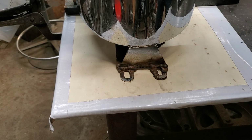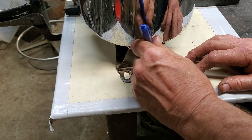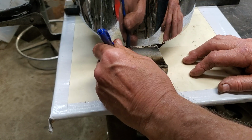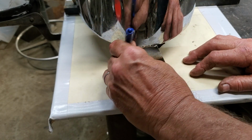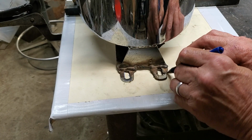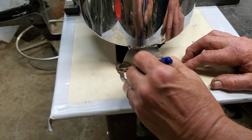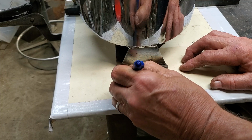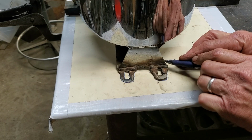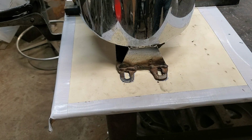And I'm not going to move this jig. So what I'll do is I will mark these. Now you can see those tabs are not the greatest. I'm going to do a 64th over a 3/8 hole, which is what it requires. I'm going to mill this out of 1 inch by 1/8 tab, and I'll cut these things off behind here and get rid of all that trash and let that set right down on that 1/8 inch piece.